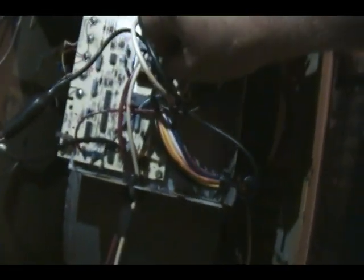What we're going to do, just to confirm with that blower, we're going to jumper it out to power and see if it'll work. We know the board's bad, but we don't know if the blower itself is bad. I'm basically hooking it to a power source. Alright, so the blower is good — we can hear that running. So now we know it's just the board.